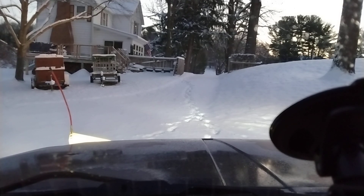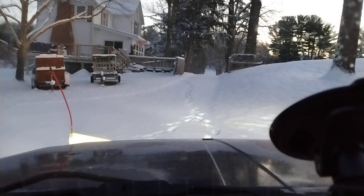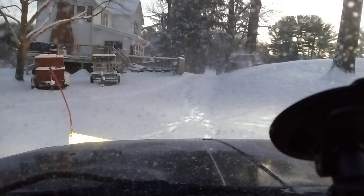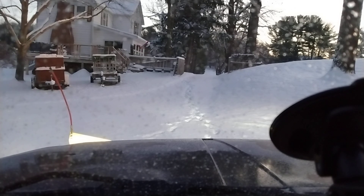First thing I see them doing in a heavy snow is running with the blade straight, and then they complain about tail off — which is the amount of snow that falls off either side of the plow. You can control tail off by which way you angle the blade. We're not excavating, we're not doing final grade work, and the angle of your blade can be your best friend or your worst enemy. People want to add wings to stop tail off, but it's simple: turn the blade right, all tail off goes right; turn it left, all tail off goes left.